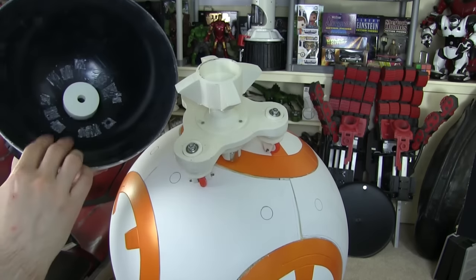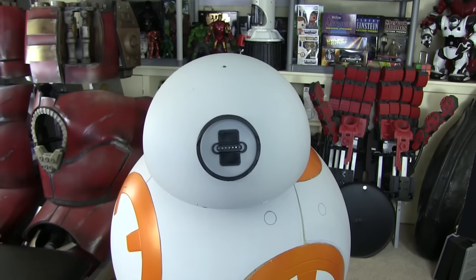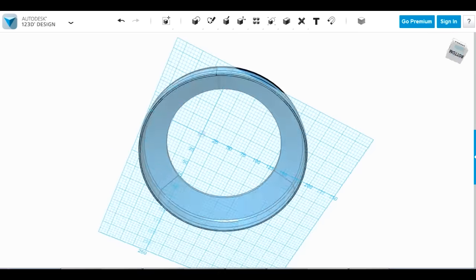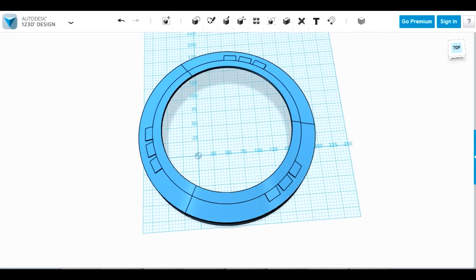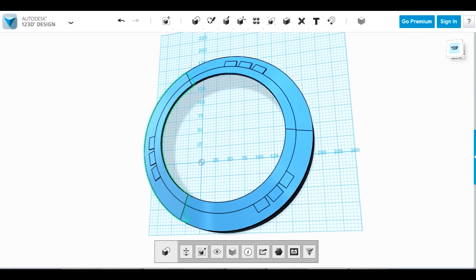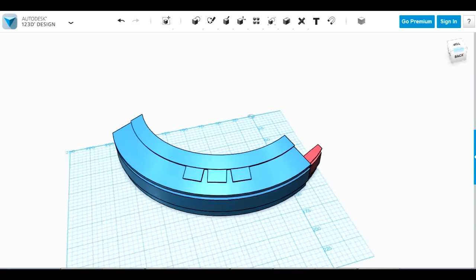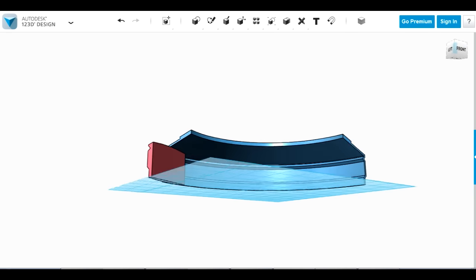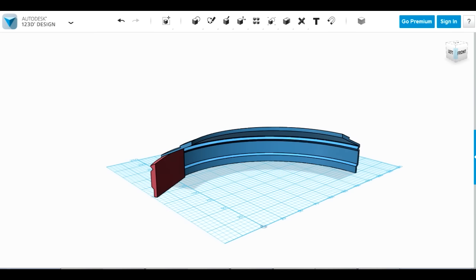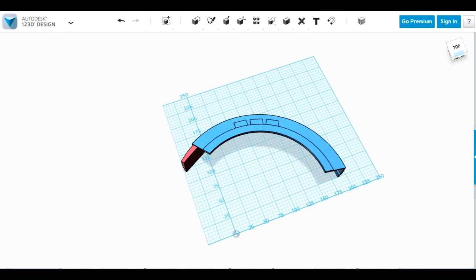So the first thing I'm going to do is try and print a skirt to fit on this, which has to fit around these casters. I don't think it's going to be quite as tight as the real BB-8, so we can try and get that head the right height. Here's the ring for the bottom of the head, which of course is going to be printed upside down, and that should print with no support material. I've put some fairly crude details on here. I could stick bits on later, but for now I've made it so I can print each third the same. I'll probably leave it because most people don't look at the detail under there, although of course it's not accurate. Here's one third of it, which will fit on the TAS print bed. I've also made these red tabs to solvent weld between the pieces. This is all going to be printed in ABS, so hopefully that will add some support around the seam. So that's a separate piece we'll print, and then we'll stick all of the thirds together, and hopefully that radius will fit just around the wheels.